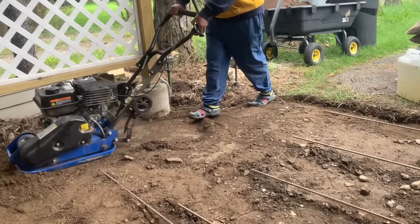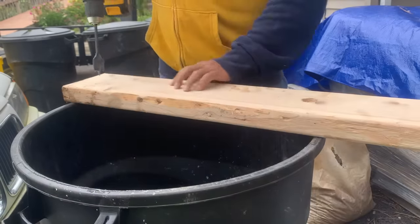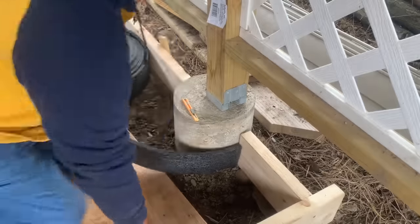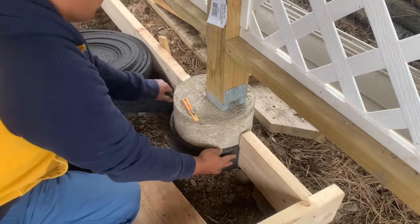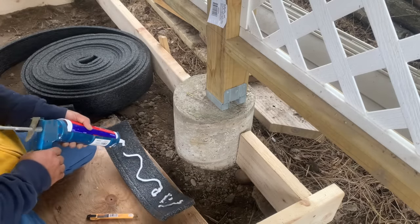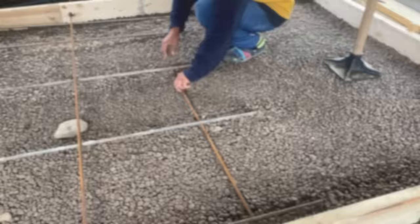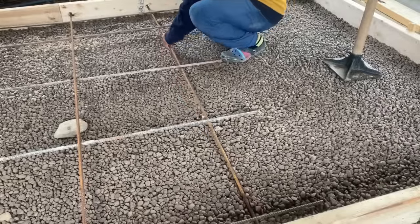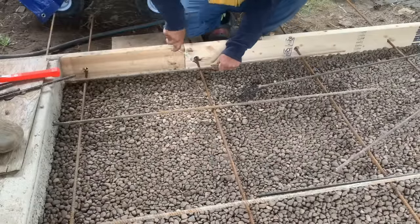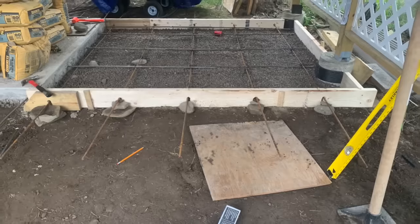Back to the compactor — making sure everything is flat. Then I start drilling holes into the new forms for the next slab, notching them where the rebar will be. I wanted to keep the piers and the slab separate from each other since they'll shift with the heaving process. I used Loctite glue to keep things in place, then ran the rebar all the way through and tied each one down — a tedious process but it has to be done. I also added rocks on the outside of the forms to keep the rebar out.